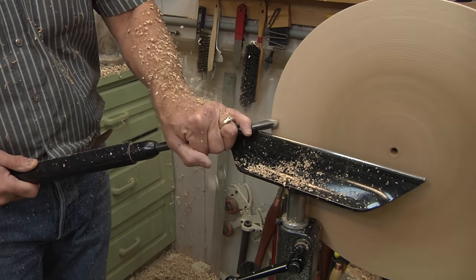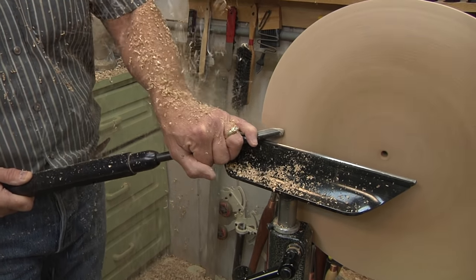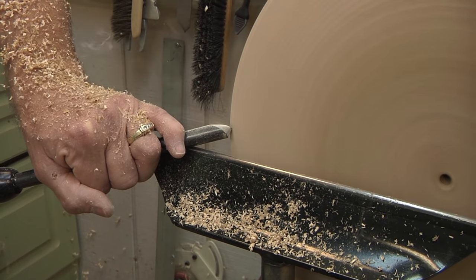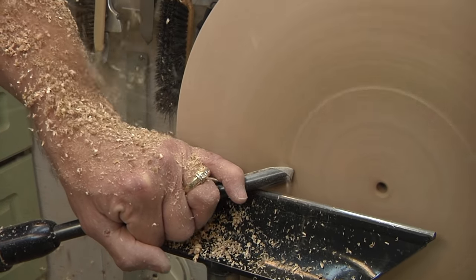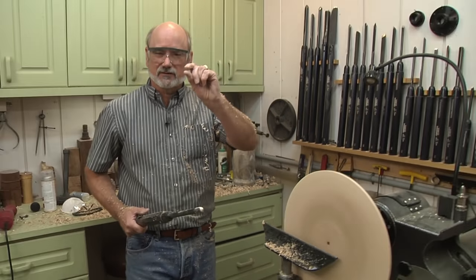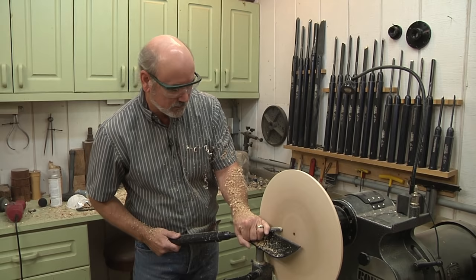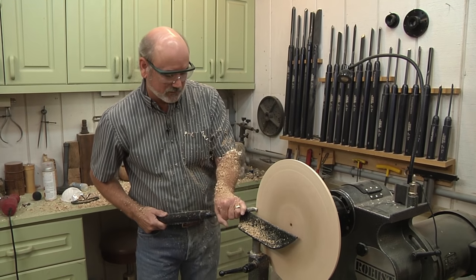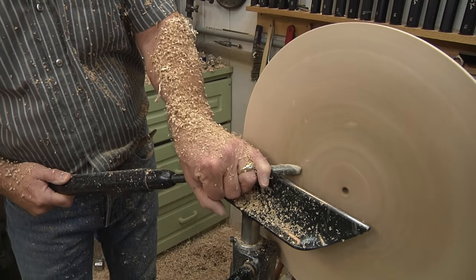I'm going to work a little more on the end here to start my curve. I'm only going to make about an eighth to a quarter of an inch curve to this. I don't want the rim to be too thin — it needs to be somewhat thick to have a proper perspective to the width of the platter. For something 14 inches wide, a rim that's only a sixteenth of an inch thin looks awkward, so I'm going to keep it about a quarter of an inch thick. We're getting our curve already and that looks pretty good.